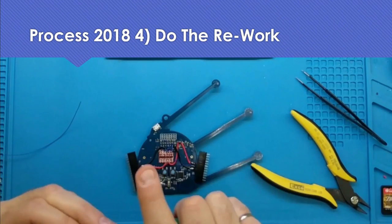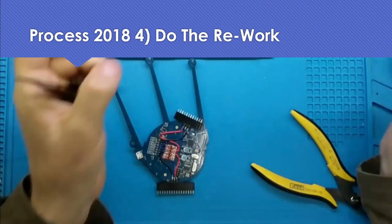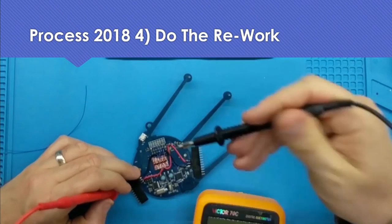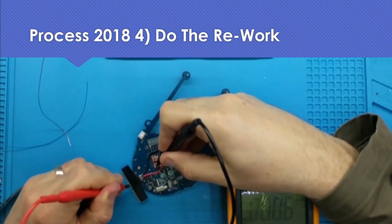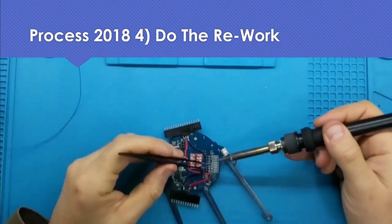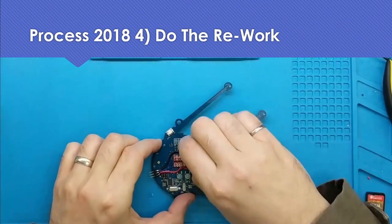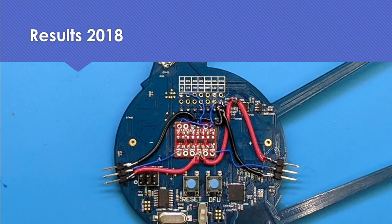We're starting from the connectors to the level translator and then going backwards to the LED signal. Tacking down the little wires with UV glue and then testing continuity — that's important. At some point I realized I had it on the wrong part of the test points, moved it over, connected it up, and tested continuity — and it worked. We used a lot of tacky flux, so it's important to clean up with isopropyl alcohol afterward so you don't get corrosion later. Here's a picture of the board for your future reference.